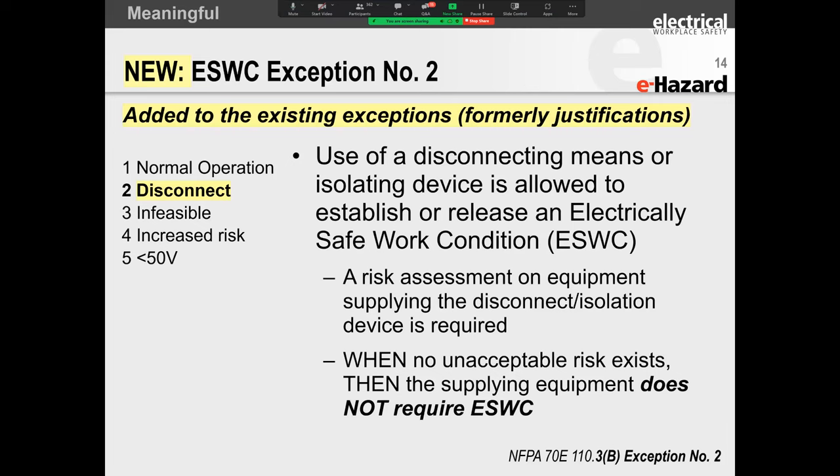That is where you're basically going to identify all of your energy sources, shut down the operation, open your disconnects, lockout tag. Then you're going to assure that your contacts are open visually if possible. You are then going to inspect your test equipment, make sure you're using appropriate test equipment. You're going to then test for the absence of voltage. You're first going to verify that your meter is operational. You're then going to test both phase and line voltage for the absence of voltage.